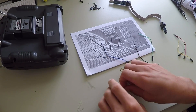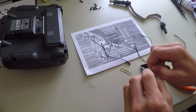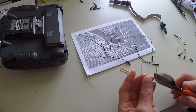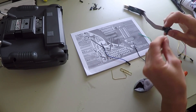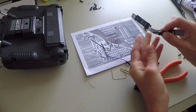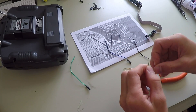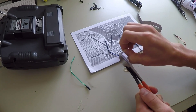Other things you're going to need is a soldering iron, some solder, a couple of servo wires, and a couple of paper clips. The method is we're going to take the servo wires and solder them into the correct places in the remote control, and then we're going to cut paper clips and use them to connect the servo wires to the end of the wire of the USB ASP device.